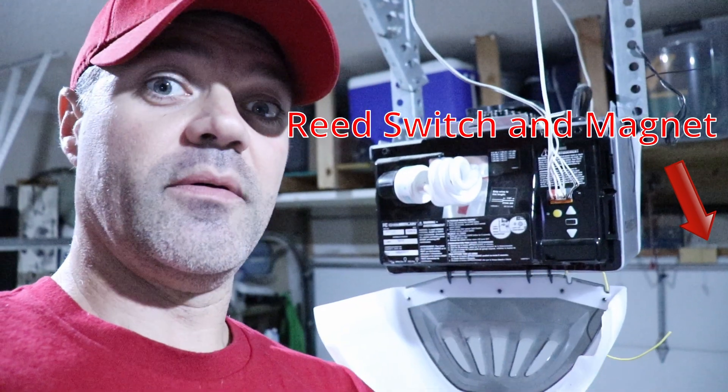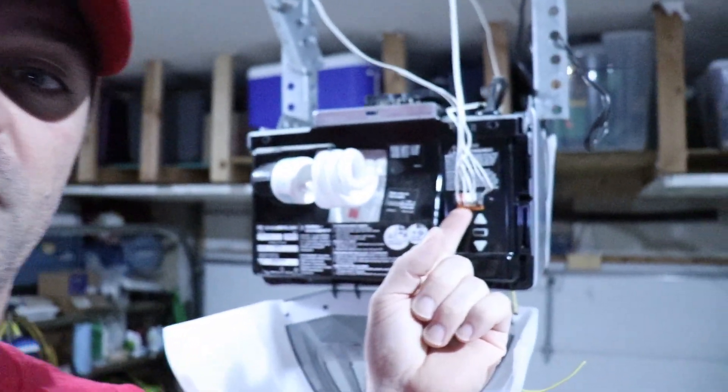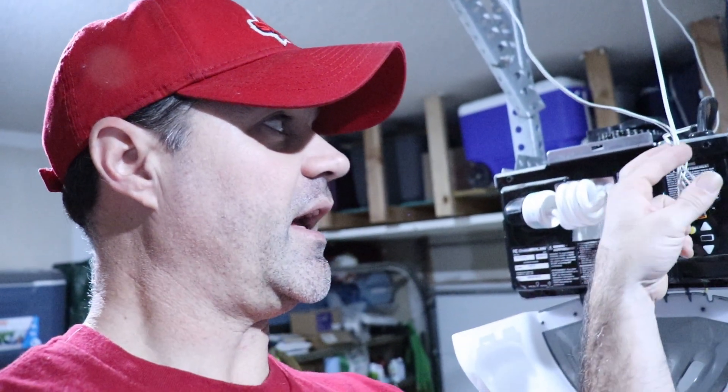The whole reason that I had to wire up the switch the way I did at the garage door opener on the wall is because of right here on this garage door opener. It doesn't have just the post with screws that you can just screw something into — it actually has this connector here. And the voltage coming out of this is inconsistent; it was switching from 4 and 5 volts to 13 and 14 volts and 11 volts and 10 volts — just all over the place. I couldn't run the Shelly switch off of the voltage coming from this. I tried to do that and it didn't work, so I found out that I couldn't trigger it normally and had no way to trigger it through the Shelly device. So I had to go through the garage door opener on the wall, which is why I made the splice and soldered the two wires, which I will show you what that looks like in the picture and explain in greater detail.